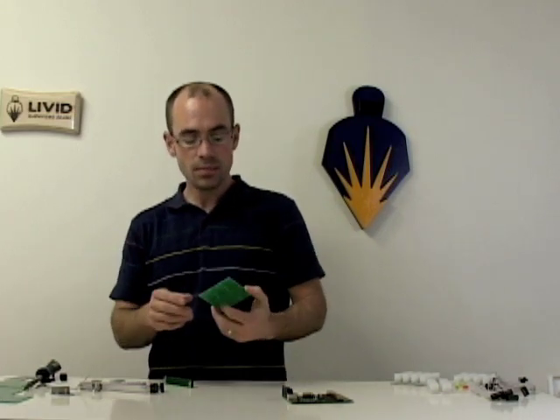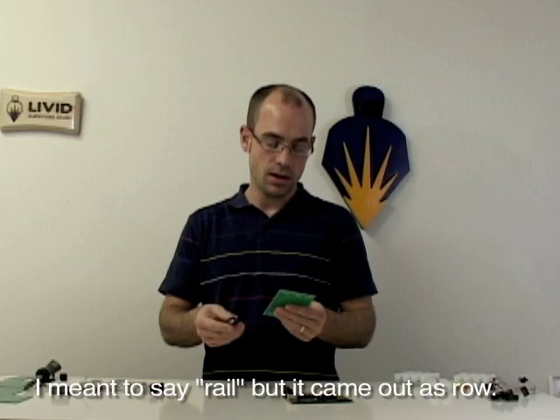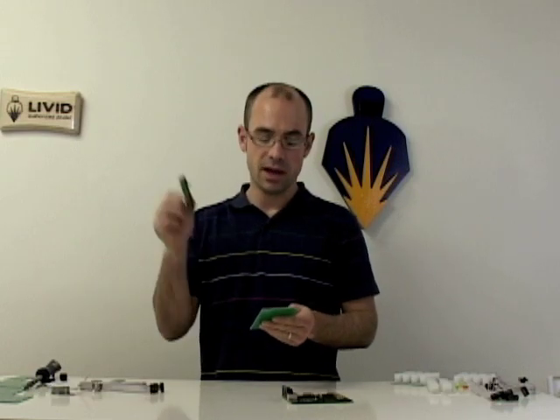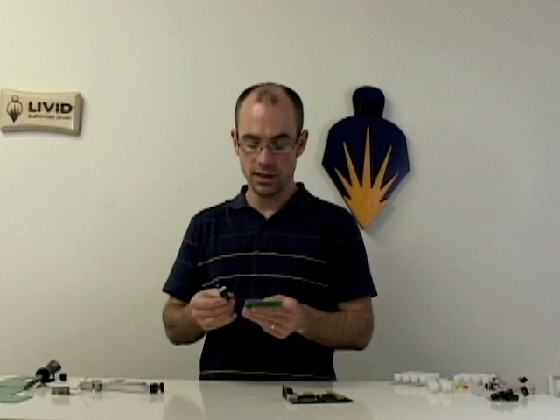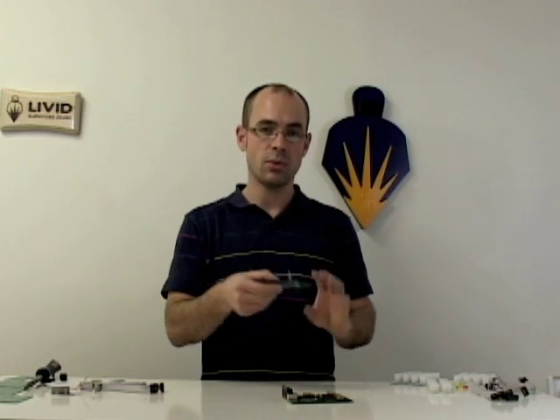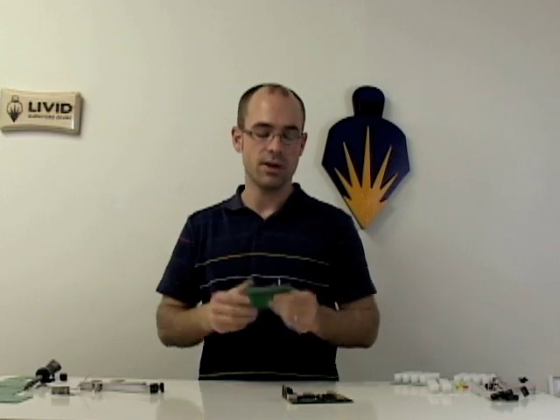There is the slide board, which can be used with pretty much any 60mm slide potentiometer, either dual or single row. Here's one that you can just buy from Mouser. We also sell our own custom-made faders — they're professionally made faders that we had custom designed for our controllers and we also sell them on our site. But this is just a Bourns potentiometer from Mouser, and you see it just sticks right in there and you can solder it right here on the back.